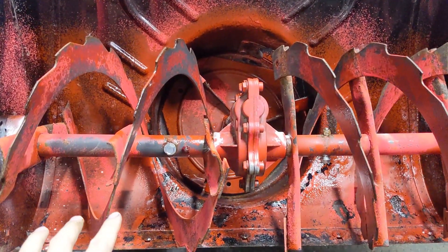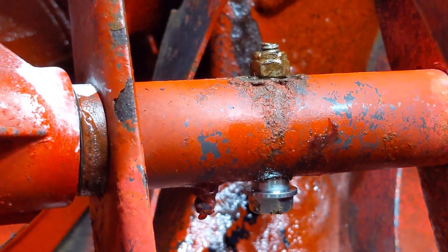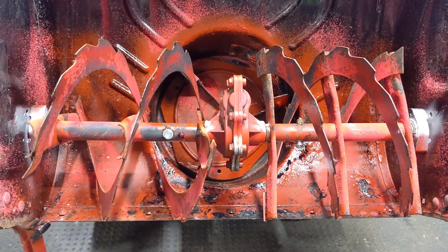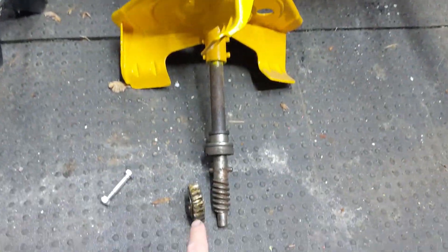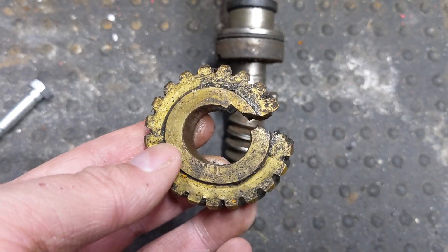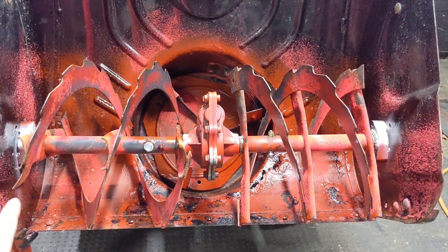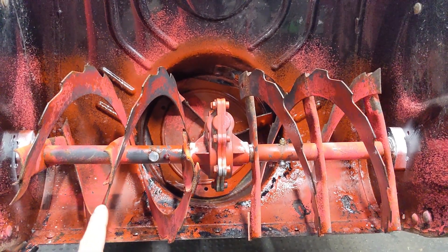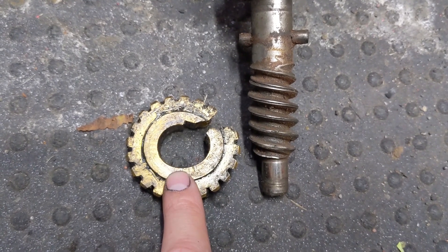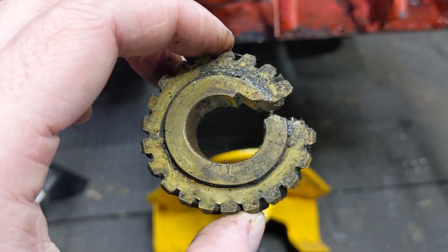My customer brought in this snowblower with normal bolts installed in the auger instead of shear bolts. We've gone ahead and installed OEM replacement shear bolts specifically designed for this snowblower to protect the gearbox. The brass worm gear is softer than the hardened steel worm shaft — this damaged one came out of a snowblower that had regular bolts instead of shear bolts. When the system jams up, all that momentum from the spinning auger transfers into the gearbox internals, and hardened steel always wins against softer brass.